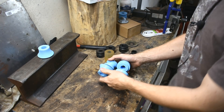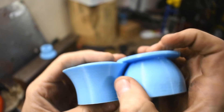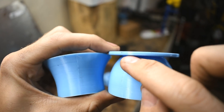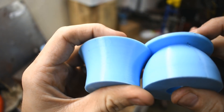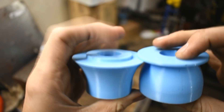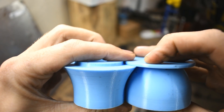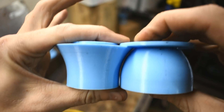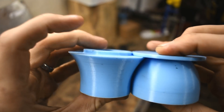I got a few right here. We're going to give them a shot. This one here is called a roundover die. The idea is you put the metal in here and it creates an angle, an arc. If you have this arc on one piece and then another arc on another, you can weld them together and you have a nice full 90-degree radius. I have an interesting guide here — some of the ones you can buy have a stopper, so when it's fully compressed there's space between for the sheet metal to go.